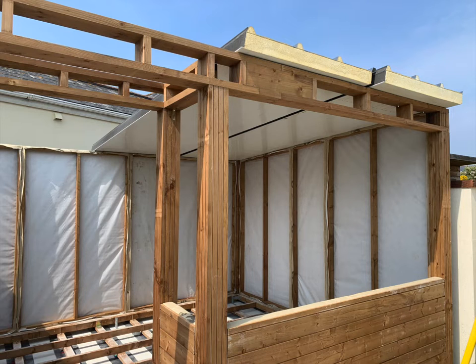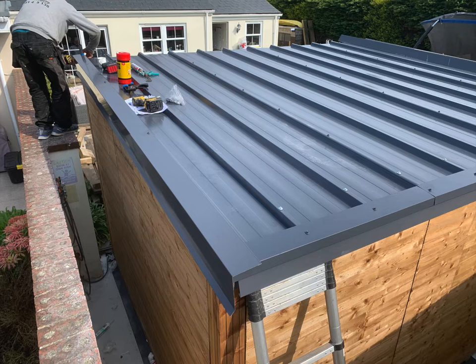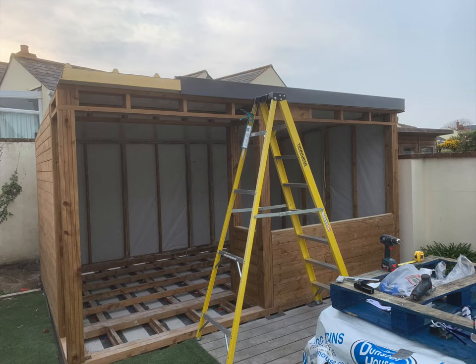This is definitely a 2 or more person job because these panels are very big and very heavy, 100mm insulated, and they've got plastic and steel and all sorts around them, which makes them very awkward to shift into the right locations. Managed to get a bit of help here, and that wall around the edge certainly aided us in terms of getting the panels into place. It really is just a case of slotting them into the right locations and then attaching this flashing that goes around all of the edges in one big metally mess, and then eventually it starts to take shape and looks a bit like you have a roof that isn't going to leak all over your building.